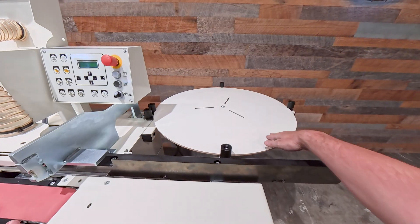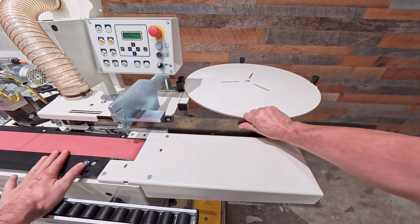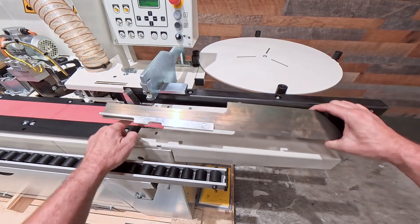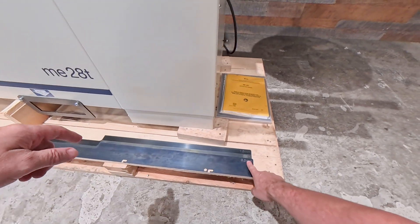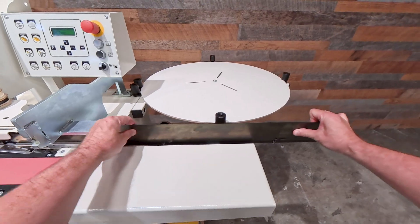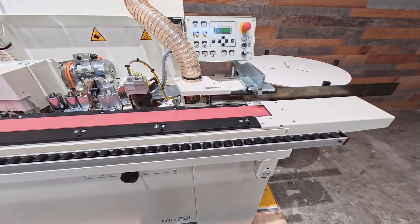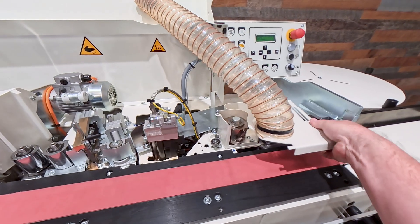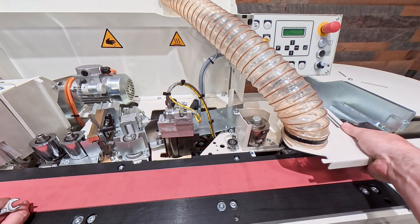You still have a nearly 29-inch carousel on this machine. The in-feed fence is very different. You are going to get these inserts — this is a zero-millimeter insert for when you're not using pre-mill. This insert is going to hit the switch and turn your pre-mill off. You also have a 0.5, a 1, and a 1.5-millimeter insert. These just drop into two pins on the fence, and there are built-in magnets — really easy to change over. Take the supplied 10-millimeter wrench, loosen that nut, and that's going to allow you to see the single pre-mill, which helps square up the edges of your board. That is the number one issue with edge banding: having a perfectly square edge.